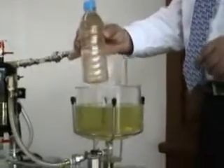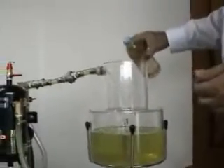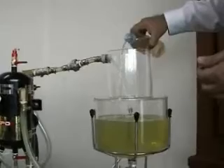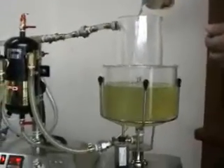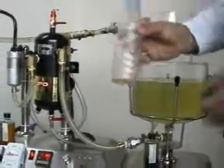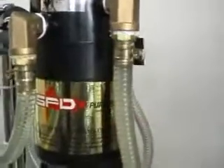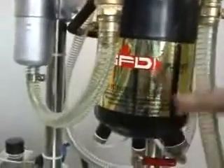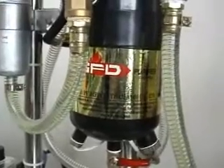This is the amount of water we are going to put in the diesel. You can see the water here, the colour of the water, and then the alarm kicks off because the water has already triggered it. Then you see until it becomes clear there is no more water in here, but it is still collecting.